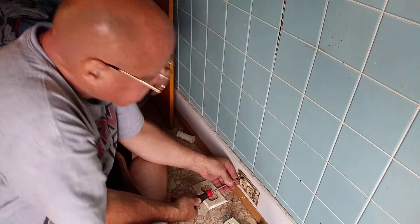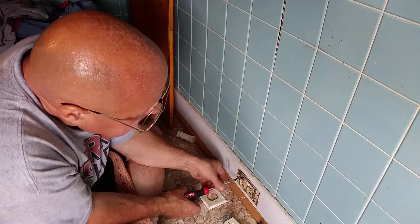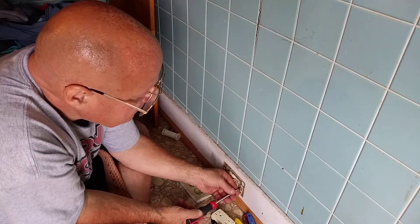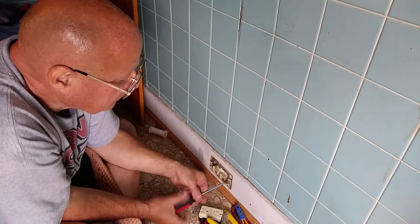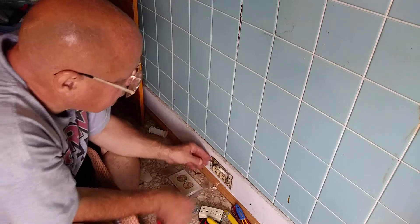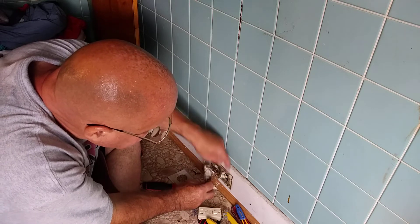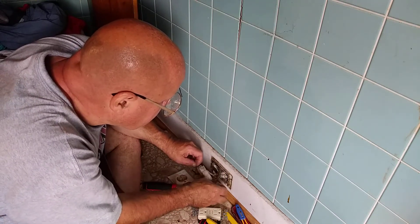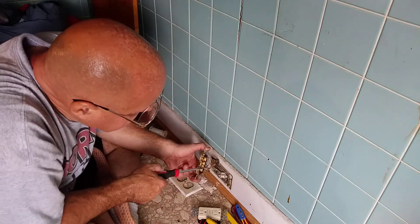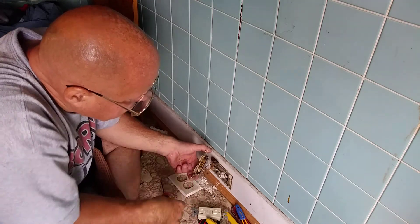It's very badly corroded and dirty. We have the Romex here with vinyl-coated wires. This outlet is broken — see how the wire is around the screw backwards, and it's on the wrong side of the outlet too.